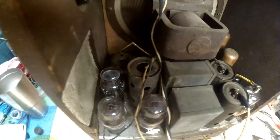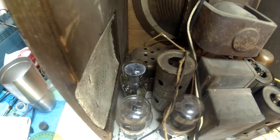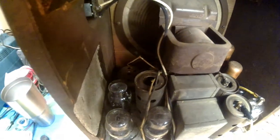As you can see in here, there's the power transformer. I'm going to have to clean it up a little bit. Since this was working at one point in time, I believe it is still good. I checked the primary with an ohmmeter, and we'll go through all the checks a little later when we pull this out of the cabinet. The schematic seems to have quite a bit of good documentation on it, so we'll document what we find.